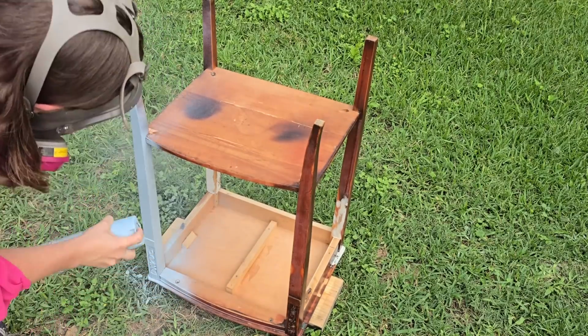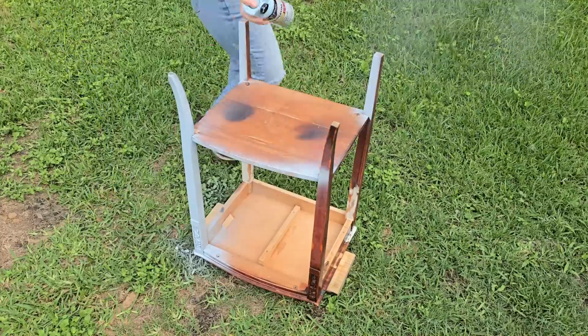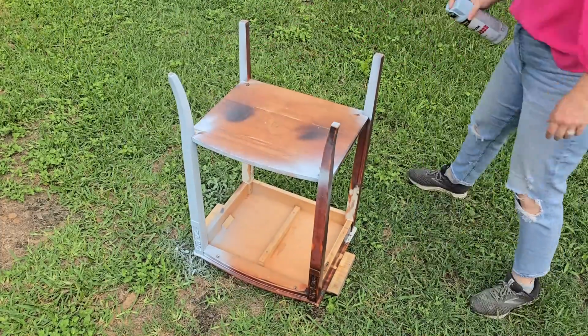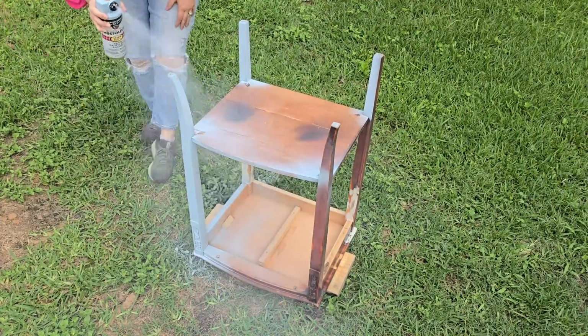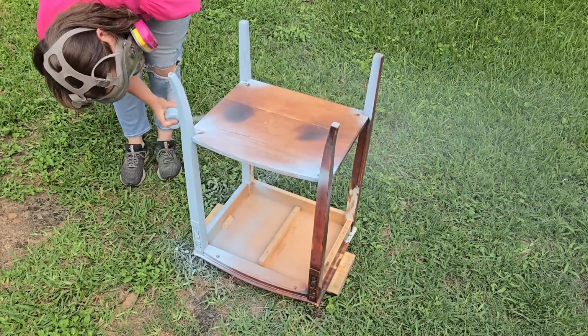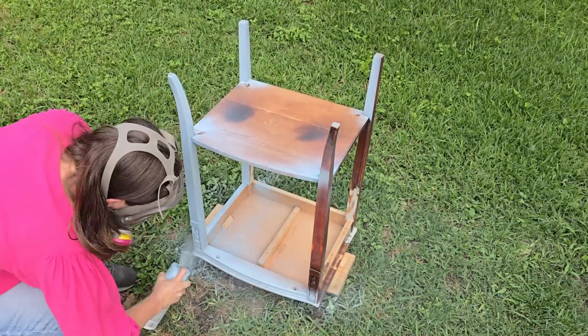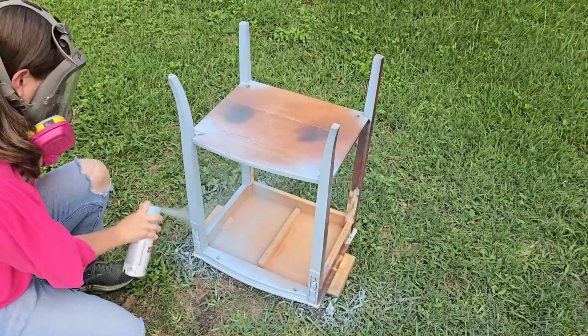When repainting a piece of furniture or flipping furniture, you should always start with the piece upside down first. If you have been watching my channel for a long time, you already know this, and you're probably already doing it too. So high five to you. But if you are new to my channel, you should always start upside down and then go right side up with your second coat. This makes sure that you don't miss any spots.